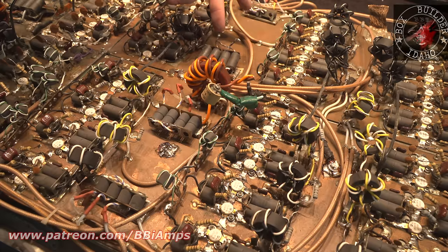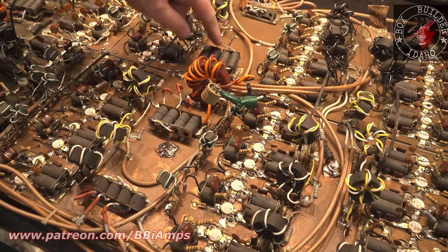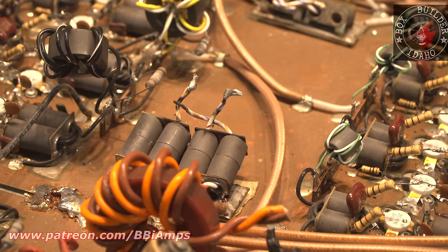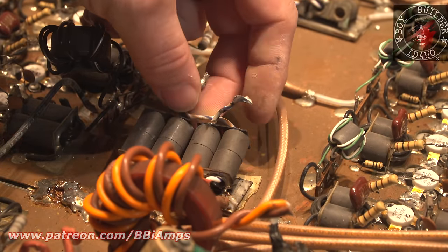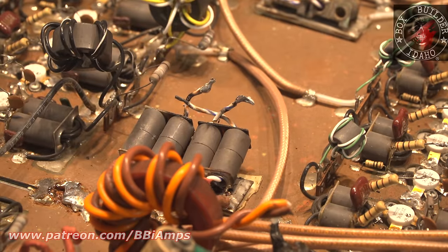The wire that is inside of these ferrite beads is not only burnt, but it is cut. This one here has got a break in it, and it has a break in it right where it makes a turn right past this toroid. I mean, burnt, like this has gotten hot. I initially thought that somebody had desoldered this. No, sir. What has happened here is this entire mess has gotten so hot that it unsoldered itself.